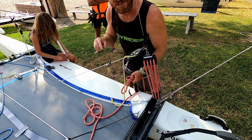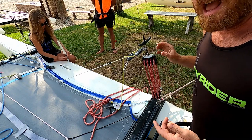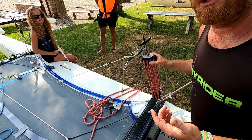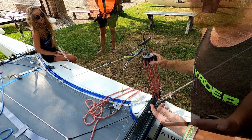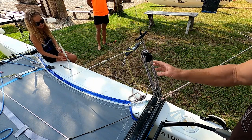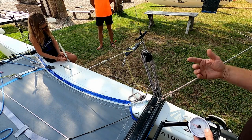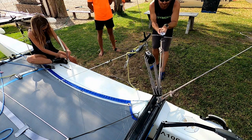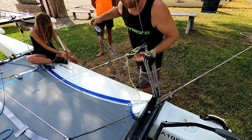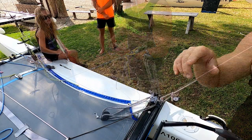We've already said we're using an eight-to-one, so if we were using a six-to-one we'd need more pressure. We now have the six-to-one on here. Pulling it to see how much is needed — that is 33 kilos, and we're in. So with the six-to-one that needed 33 kilos.